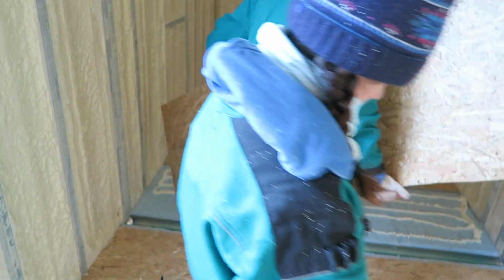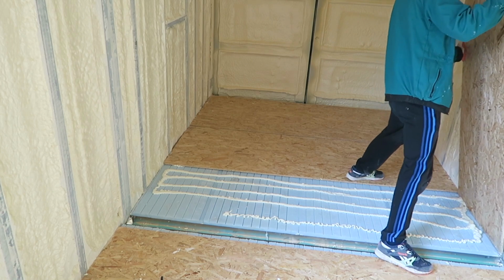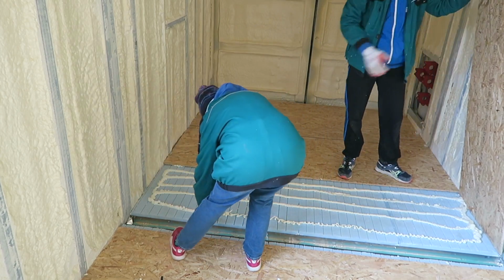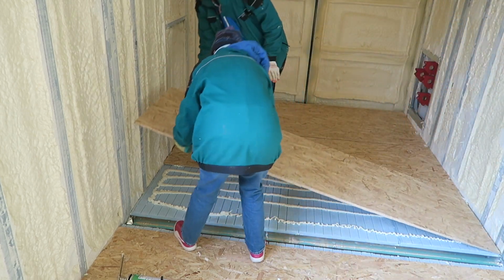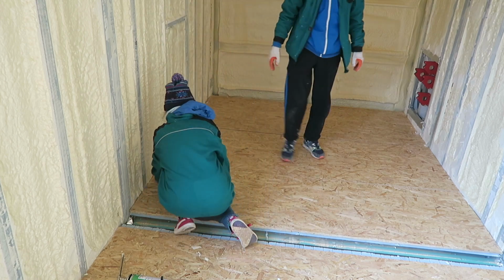We have now a proper floor, and we can continue building the rooms and adding the wall panels. The OSB floor will stay in place until the final part of the interior decoration, where we'll add a layer of hardwood oak flooring. We decided to go for oak as it is a very good hardwood and the floor can be kept in shape with small service every few years.